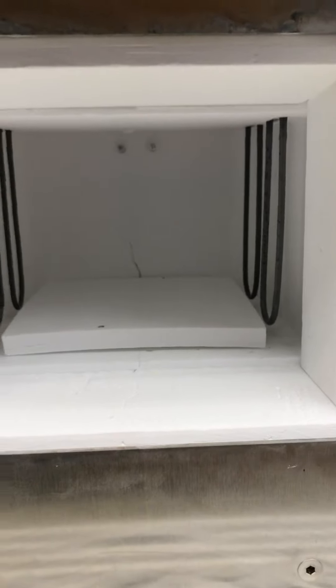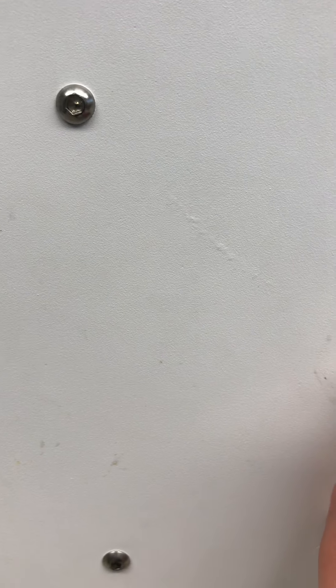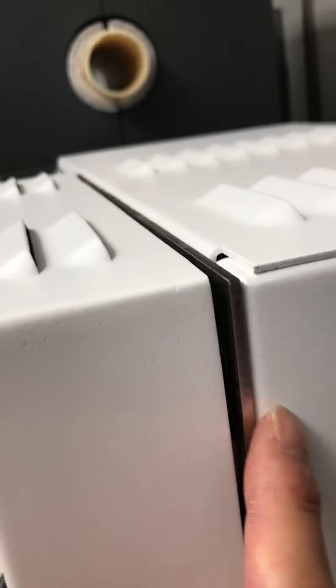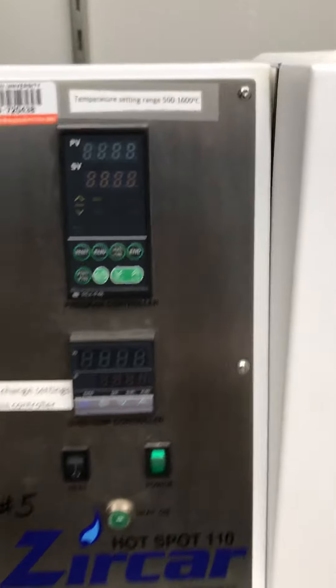All samples should be seated in the middle. Then close the door — press that notch and hold the door slowly, it's a little bit heavy. Make sure it aligns, then lock it. Look at the side — it shouldn't have a big gap. If there's a big gap, that means it's not in the slot, it's not locked, and it may release the heat.